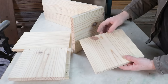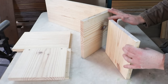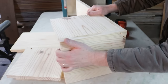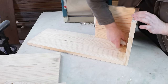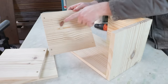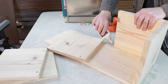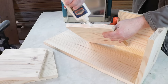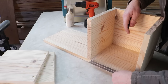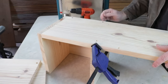The next part to be used is this one that measures 23 centimeters. I'll apply glue here, and it will be attached like this. I aligned the parts very well and can now fasten. Before proceeding, it's always good to clean up the excess glue. Now the part to be used is this one of 25 centimeters that has holes on both sides. I'll leave this countersunk part facing up and apply glue. It will be attached like this. I'll make a marking exactly 23 centimeters, then place a clamp so that it stays exactly in the necessary position, and now I can fasten it.